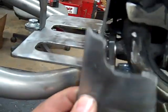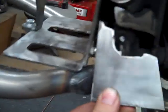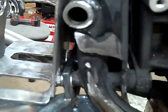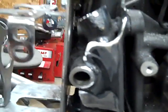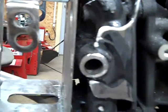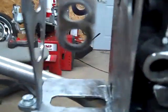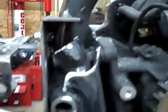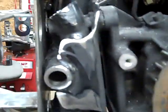These are the side plates that we showed you earlier. This is only on the narrow frames. The wide frames actually, because of the offset on your sprocket, you need to clear the wide tires, come with a battery box that will just cover all this in one chunk. But like I mentioned before, on the skinny frames, especially if you're running a belt, you just cannot get past this plate here, or you will have clearance issues with your drive belt.